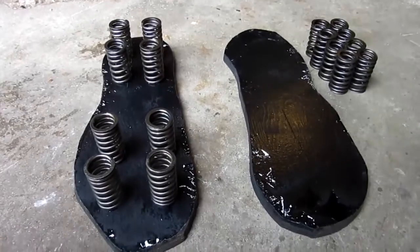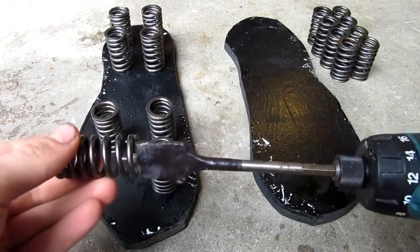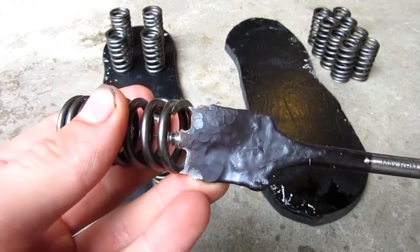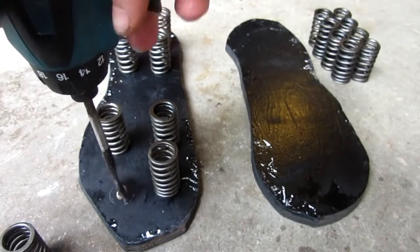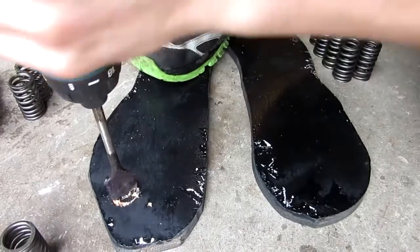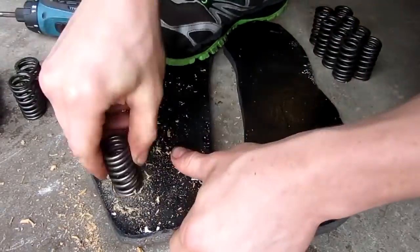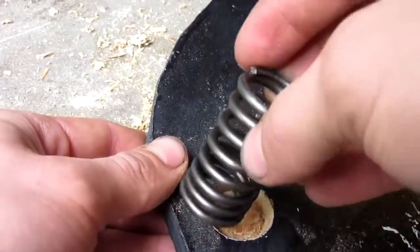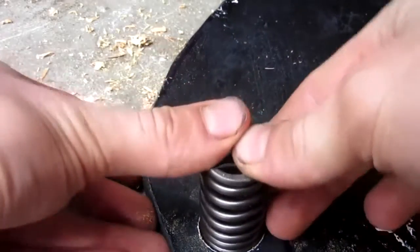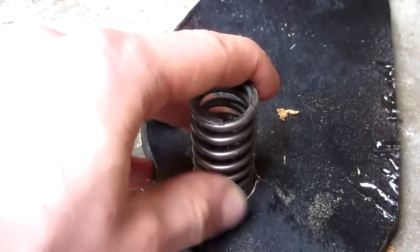To do that, we're going to grab the drill and drill bit. This is a one-inch drill bit right here — it depends on what size spring you have, but as you can see it is about the same diameter as the spring. So I'm going to go ahead and drill a hole. So there we have the drilled hole. It was a little small, so I basically wiggled the drill around and widened up the pocket. This by no means will hold it in place — it's strictly going to be used to seat it a little bit. If I push and even spin a little bit, it actually gets kind of seated in there. So I'm going to drill all of those and then we'll get to gluing them in.